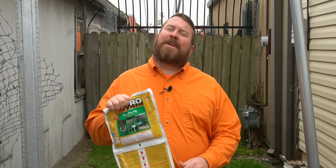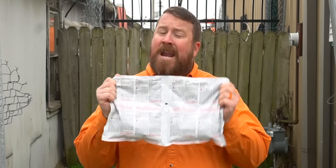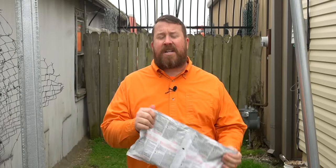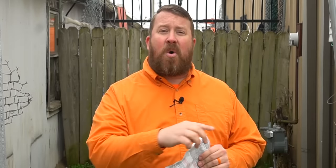I would expect the process and the results to remain the same no matter which brand you choose. The expanding foam products come in two parts — a part A and a part B. The process is you mix the two parts together for about 15 seconds, then cut the corner and pour it in the hole. This moves really quickly: you only have 15 seconds to mix it, and once it's in the hole, you only have 10 seconds to make adjustments to the post. Make sure your post is completely level and in line before the foam goes in the hole.